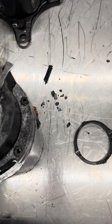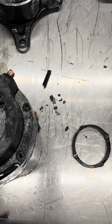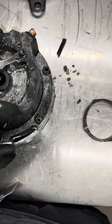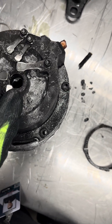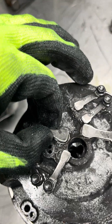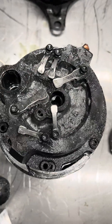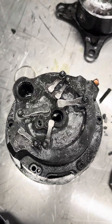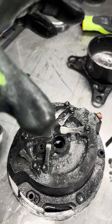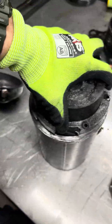You can see where I've pulled all these high-pressure checks out. These are just for differential pressures within the compressor. High-pressure scrolls such as this operate at low ambience with vapor injection. If it gets to a certain point in that compression process and reaches the desired pressure, instead of going through the entire compression process and all the way around the scroll, it will push open these plates — one is a sealing plate underneath and the other is the actual check. This has to be strong enough to bend this metal backwards to release high pressure and bypass the compression process, and that's for efficiency at low loads and high-pressure differentials. But as you can see, this entire thing is just coated and blasted. Vapor injection port on the side, suction port here — still not pretty, but this is where it gets good.